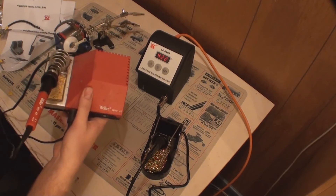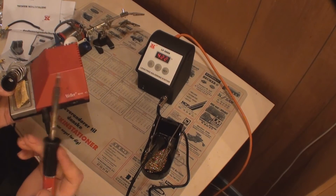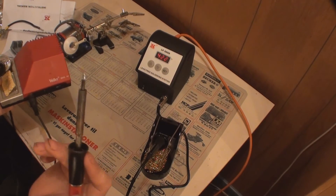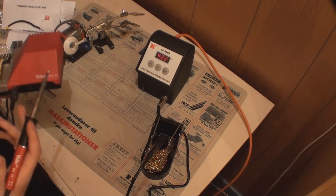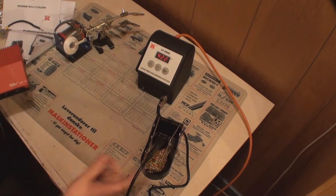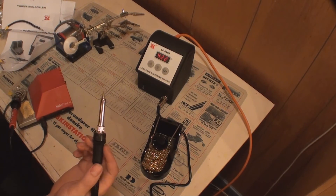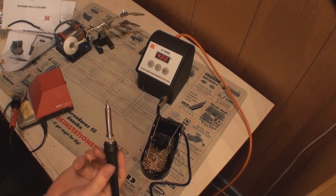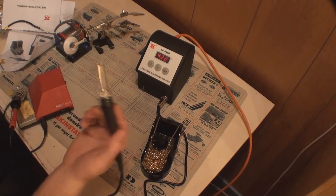Here I got my old soldering station and I will continue to use it, but it has no way of transferring that much heat that my new one can. It has almost no thermal capacity in the tip in terms of construction and is only good for small soldering work. But this new one is better to transfer more heat — it has more than twice the power of the old one. And I got a much bigger tip for it, and also a small tip for SMD and stuff. So I think it's a pretty good buy and it cost me quite a decent amount.